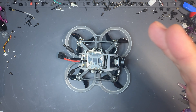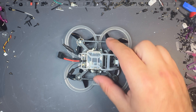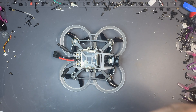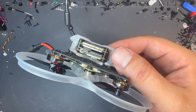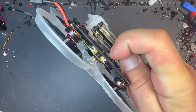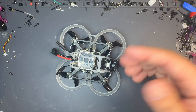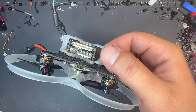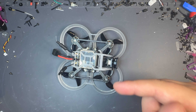When you buy a Pico kit from BetaFPV, it's going to be without the VTX, so you have to install your own. However you get your naked O3, whether you do it yourself like I did here or you buy the pre-naked ones from Flywoo, the installation will kind of be the same. It's essentially the same as the O3, but we lose a little bit of the dimensions so it's not going to fit snugly. How I dealt with that problem is I printed out a 25x25 adapter — the same style adapter that Beta included for mounting other VTXs like the Walksnail VTX and 20x20 mounted VTXs. I just printed one out in TPU. I'll include a link to the STL in the description.